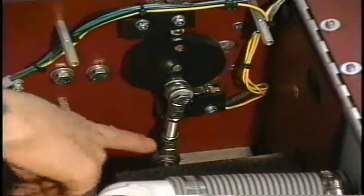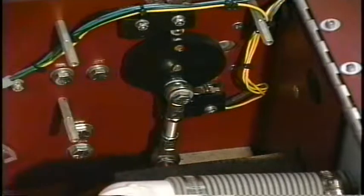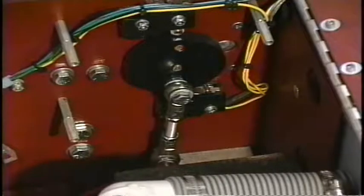If we have to adjust this, we would simply break loose the jam nuts and remove the mounting bolt that goes through the eyelet of the turnbuckle and into the squeegee cam. There is also a jam nut in between the eyelet and the cam, so you might want to hold this with either your finger or a thin half-inch open-end wrench while you unscrew the mounting bolt. Once the turnbuckle is free of the cam, you can adjust the length by turning the eyelet and the threaded rod. Remember that the eyelets and the rod are normal threads — if you adjust only the rod, it will thread into one eyelet and out of the other. So if you are making a large adjustment, it is best to adjust the rod in and out of one eyelet and adjust the opposite eyelet that equal number of threads.